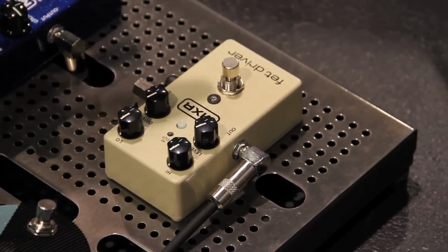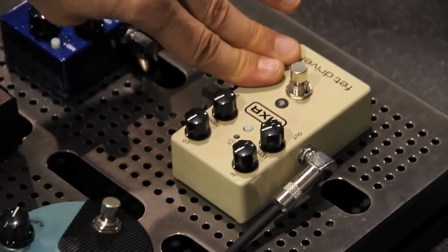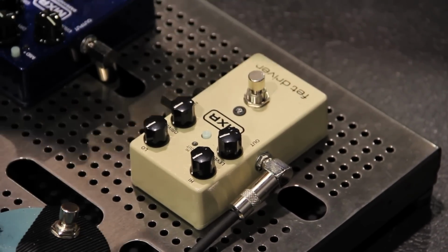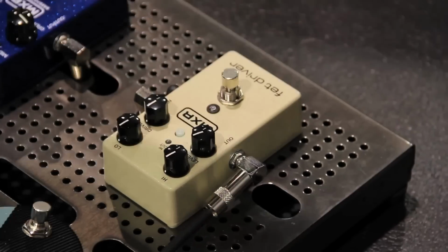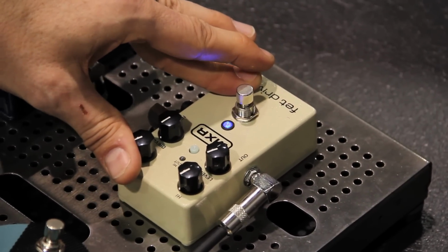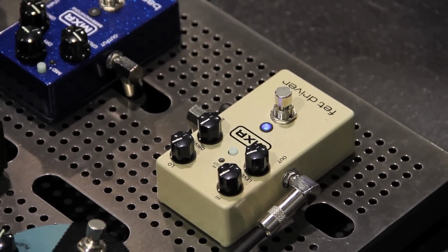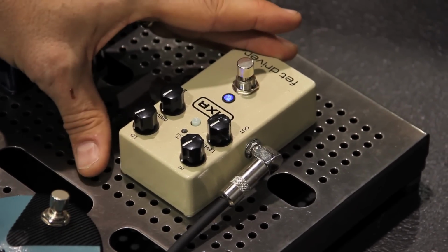Moving to the FET driver, the same thing. Overdrive, giving it a push. Instead of tubes, the FETs kind of replicate the effects of a tube in the way it saturates. And what we do is we bump up the internal supply so we have a bit more headroom to work with, which is great, especially with FETs. You want to make them breathe a bit. And also, because of the larger headroom they have to work with, we can make it sort of biased asymmetrically, so you get a very interesting second order harmonic distortion, yet you still have plenty of output.